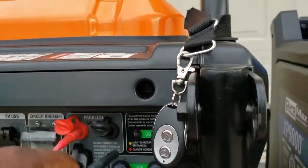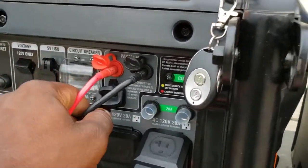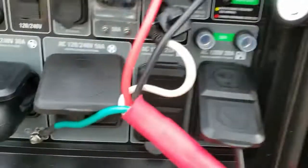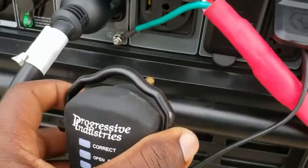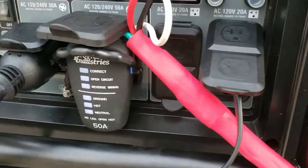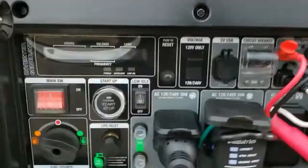I'm going to put red to black, and the neutral I'm just going to cap it off — on this side you can see the neutral is just kept because there's no spot on the DuraMax side. It does have its ground, that's all it needs: two legs and the ground. The ground is connected over here too. I'll use the meter on this 50-amp plug — let's plug that in right here so we can see if it says correct. I'll put the link in the description if you want one of these.